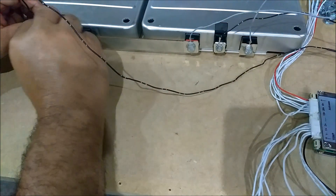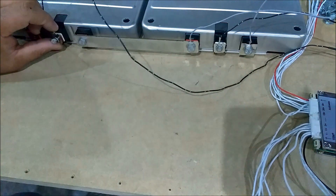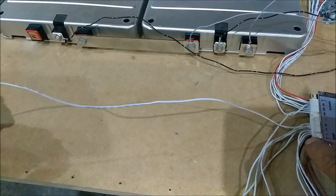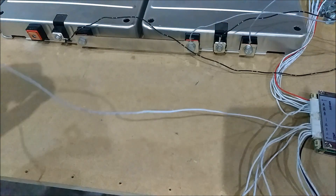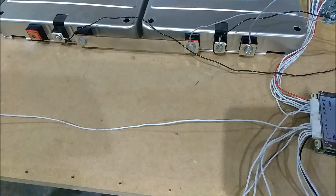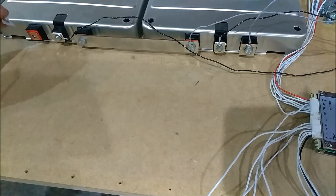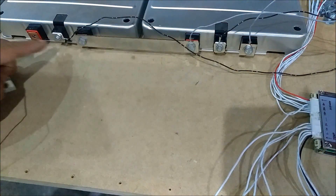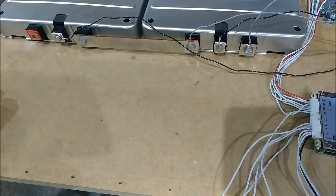You're gonna take your screw, put it right in on here. Alright guys, you got number four — you're gonna count over from the black wire, go to the first white wire: one, two, three — and this is number four, the number four cell. Number four is gonna hook right here, but before you put this on I gotta put another one of these crossovers to skip over to the next battery.